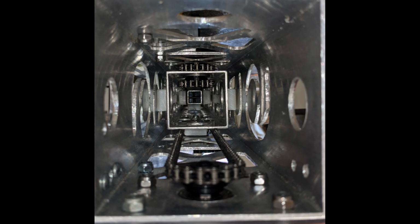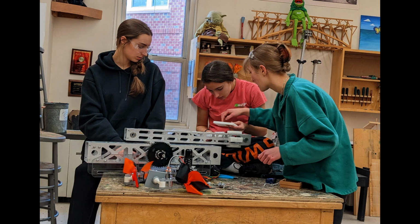For the chain anchor, we cut nylon blocks, fastened them to the bottom of each tube, and drilled and tapped a hole to screw into, holding the chain anchor in place. The nylon blocks also double as slider blocks that help keep each stage aligned inside their outer housing. Finally, we cut 1/2-inch aluminum hex shaft to length to hold the sprockets and retain them with shaft end screws.